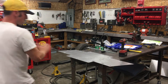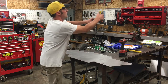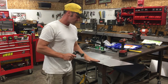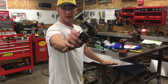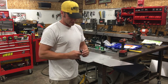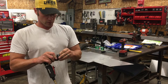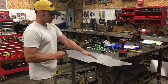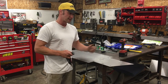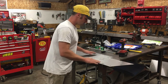Next part of the process: I went ahead and ground a little bit of this off. I used a flapper disc — I use a flapper disc for a lot of different things. The plasma cut was so nice it didn't really take much. I've got a little flapper disc on my quarter-inch grinder with a roll lock design and it works really well for light grinding, especially when dealing with a little bit of slag from a light plasma cut and the burrs from drill bits coming through the back side. I cleaned them up and then drilled these out to the right size.